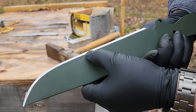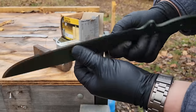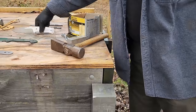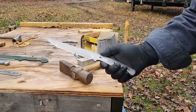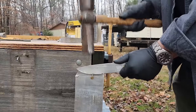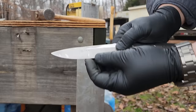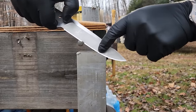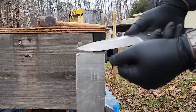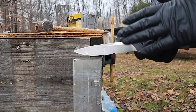We got a little dent right there — very minimal damage. Sometimes in the videos the knife will be smeared on the edge bevel and it will look like edge damage, so we'll take a picture after the video so you can really see that clearly. That's pretty nice, I really like this. MagnaCut with one of the prescribed heat treats — you can see we've got a little dent right there. That is really strong performance for a stainless steel. This is hanging with these really good carbon steels — better than most, almost as good as the best. That is really good edge stability going through a nail like that. I'm really impressed with this steel.